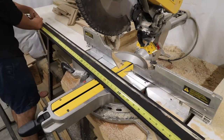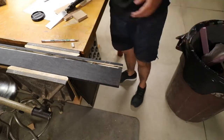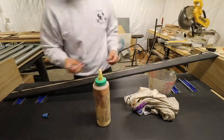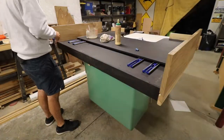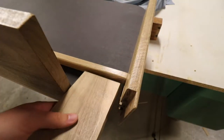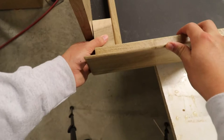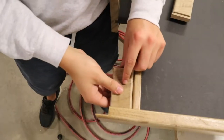To add some rigidity, we cut another small plywood slot that's going to fit onto the back section of the keyboard tray. Here I am securing that plywood piece into place. I was worried about the force that was going to be applied on the face pieces when using the keyboard tray, so I made a small section to add to the rigidity. The small pieces fit into the upper dado section.